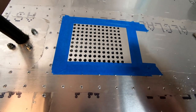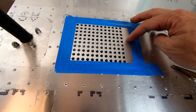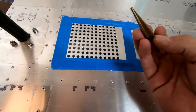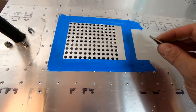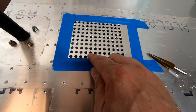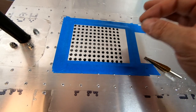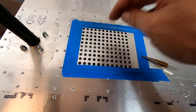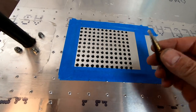Using a step drill, the holes were taken down to 7/32 inches with one more step needed to reach the final 1/4-inch size. Leaving the template over the sheet metal while using the step bit worked very well — the template acted as a barrier preventing the drill from going oversized, stopping the bit after each step even when it started to bite the next size.